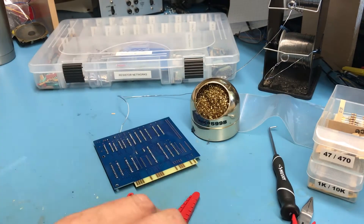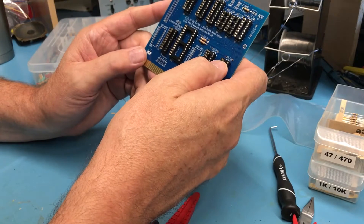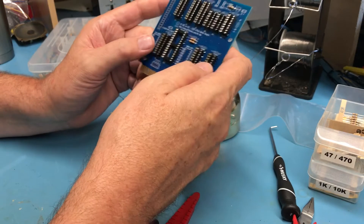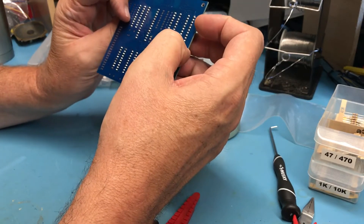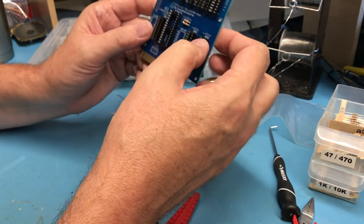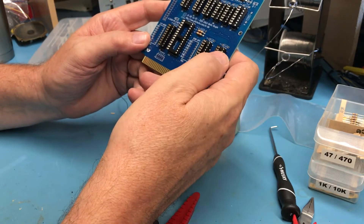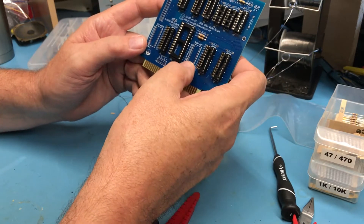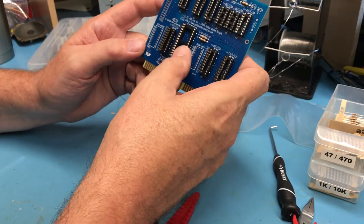I think I'm going to have to go find a schematic for the board. There are two resistor networks it calls for, which are probably either 1K or 10K — they're next to the DIP switches, so the odds are really good they're pull-up resistors. Looking at the board I see this ROM enable here and I'm curious if I can jumper this for a 27C256 rather than a 28C256 — it'd be easier because I've got plenty of those.